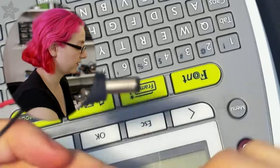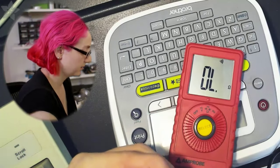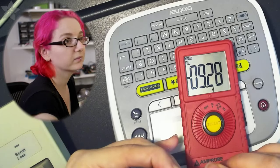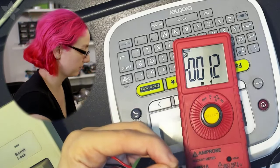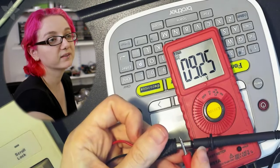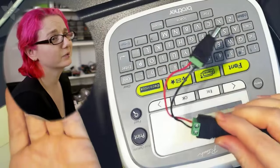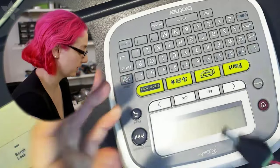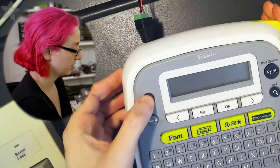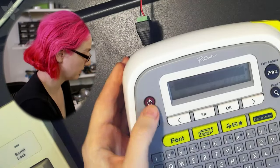So if you plug in the center positive here, then when you measure with your multimeter, oh, don't put it in continuity mode, it's now, the center is negative, or if I put in ground, you'll measure that it's 9 volts with the center being ground. Switcherooer. Anyways, I can later on make a custom cable, but you know what? This works pretty well. Especially for such low voltages and low currents. Okay. So you plug this in, and you're, oh man, I'm just dropping everything. And, oh, now it's working. That's interesting.